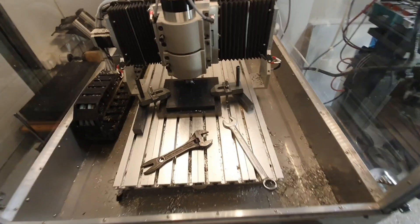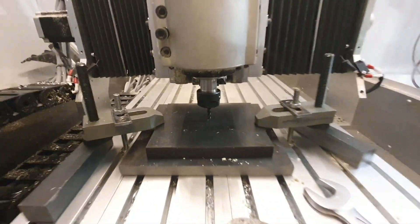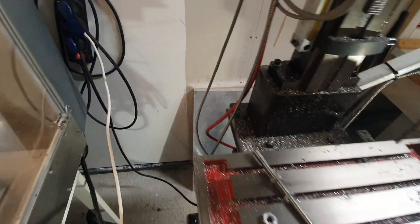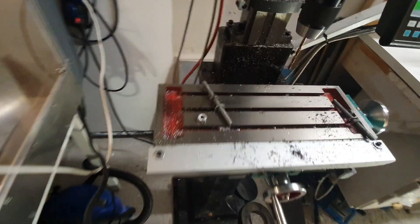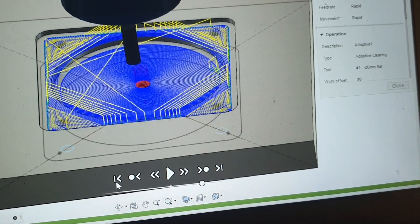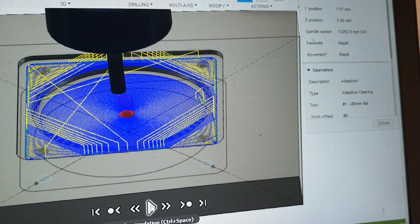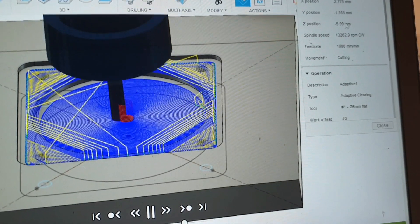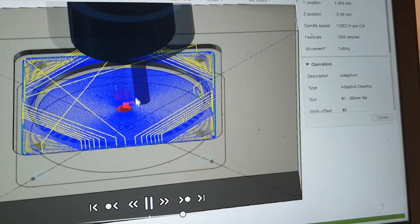We are now zeroed and I've mounted a roughing end mill — I have no idea how this will work out. If you're new to my channel, I'm about to upgrade this table here and add a 25-millimeter, almost one-inch thick solid aluminium plate, which will hopefully get rid of the vibrations. While the spindle is warming up, let's take a look at the toolpath in Fusion. I'm using 3D Adaptive — the plan is to ramp down in the middle to negative six millimeters and then rough away a lot of material.